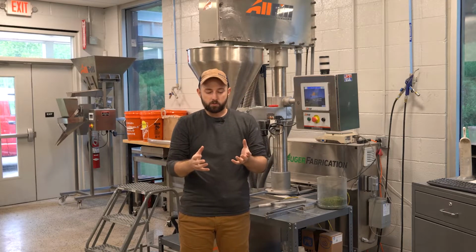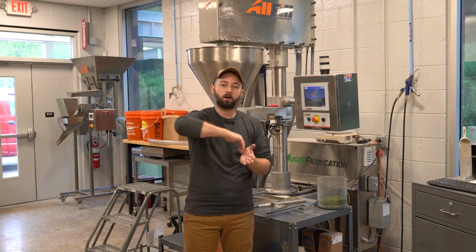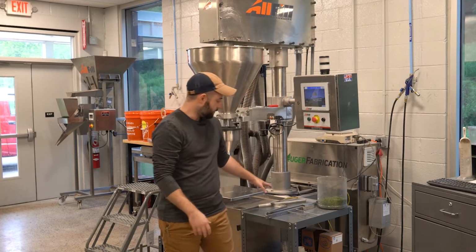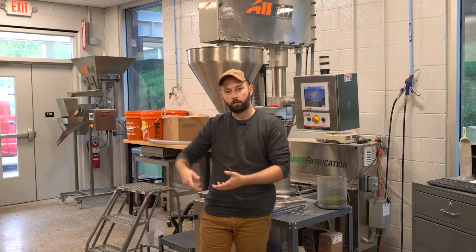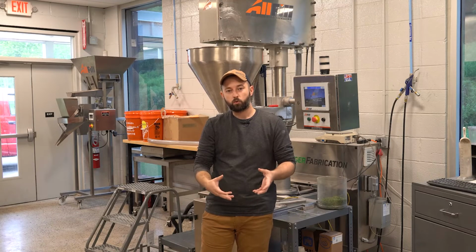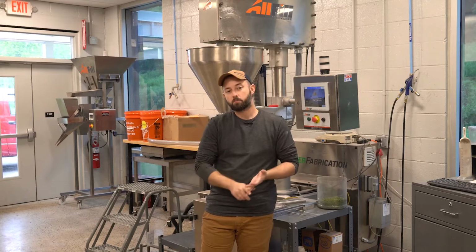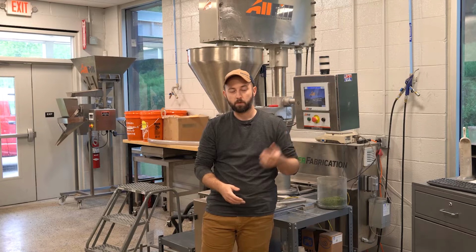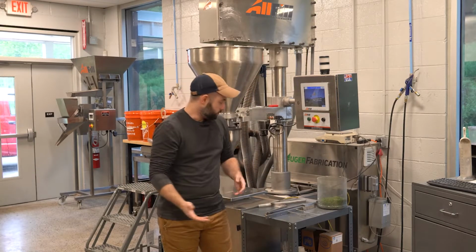And what that does is you're not creating effective agitation. So a good agitation blade should be cutting through the material in the hopper to the best of its ability. With a slow speed blade, you're not cutting through with materials like this. You're grabbing it and dragging it. So you're not actually agitating the material and getting it to fall into the tooling of the auger filler. So you'll notice it'll starve, your cycle times will change, you'll see weight differences from cycle to cycle, especially on a volumetric filler. So a flake blade was designed to alleviate that issue.